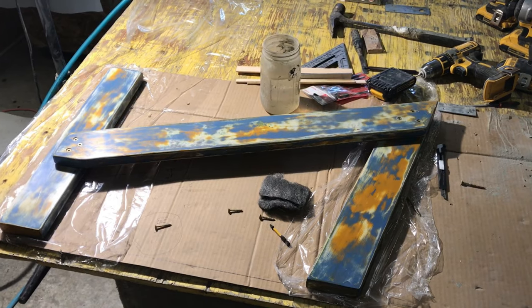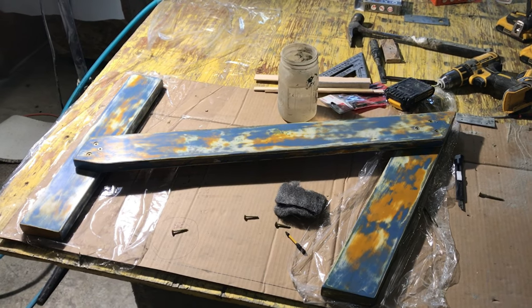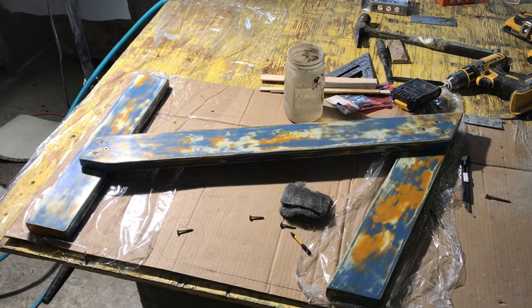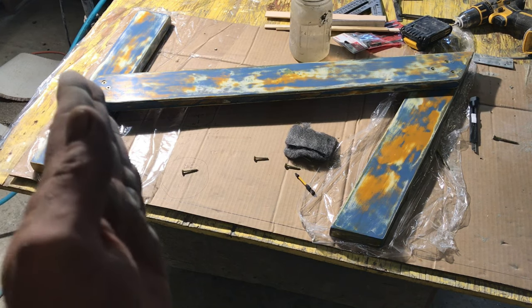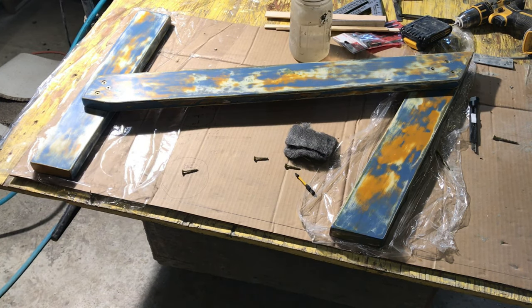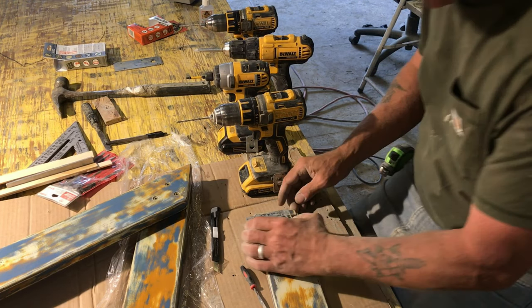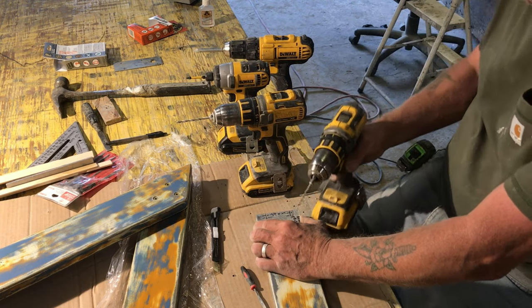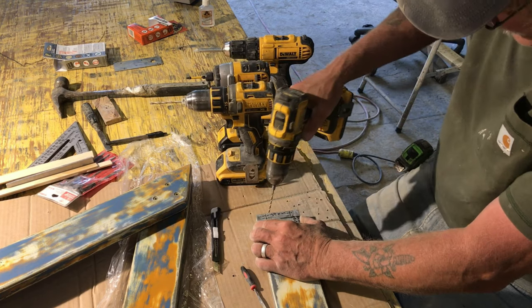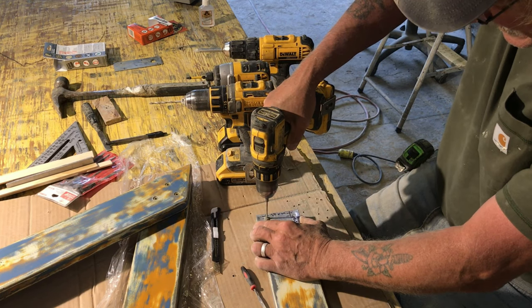This is the first three pieces I put together, and I've glued it with Gorilla Glue. It's pretty formidable — it says it dries in two hours, I've got two hours in now, but I don't want to move it. I still got to put the armrest on here and I don't want to affect the straight line — the actual form of it — until tomorrow. I've got a jig that I'm using; it gives me an alignment. I just take my small bit to start out, just to give me kind of a pilot hole.